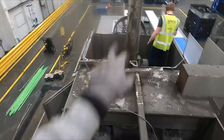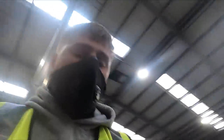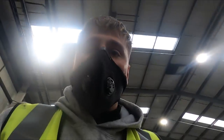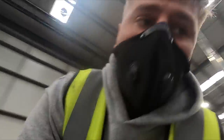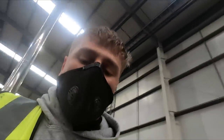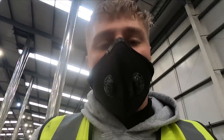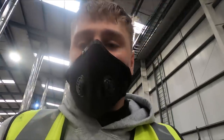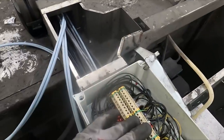if I can get up here, are four conveyor belts. You can just sort of see them. What they want on the conveyor belts is control over them, so forward, backwards, and then they also want the e-stops to be in the same position as those controls. So it failed a health and safety test. They want it all in the same place so it can all be controlled safely and securely. So what that means is we've had to take four 7 cores for the e-stop buttons back to here. This is where they're originally wired from.